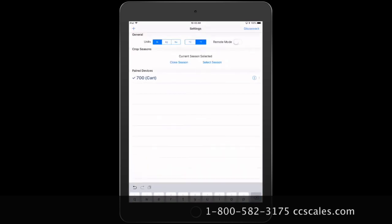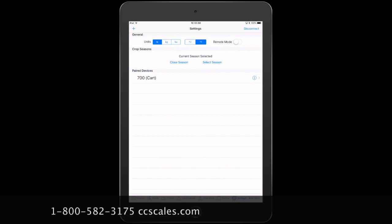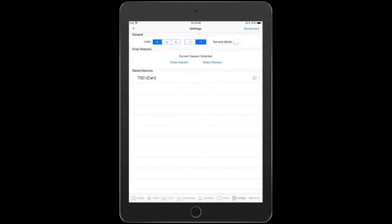To pair again. Okay, so one more layer. Let's say that none of this is working whatsoever. The next thing that you want to do is look on the inside of your box and make sure there is no moisture on the inside. So that's why in that previous video we made sure that we mount it in a place that's not going to take in moisture. And also on the box, make sure that you don't get a bow in the middle. Make sure all 4 screws are tightened down with that gasket going all the way around, so that way it's pretty well sealed up. But if you get a bow in the middle, sometimes it can take water in on both sides. So the biggest thing there is just make sure you have that tightly secured.